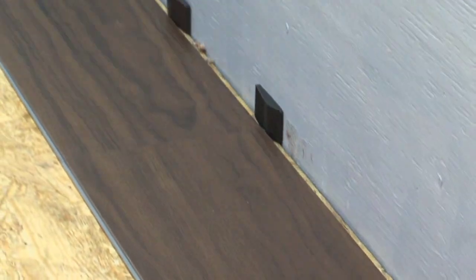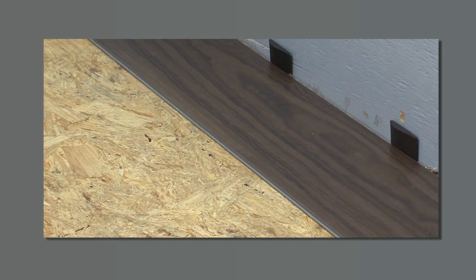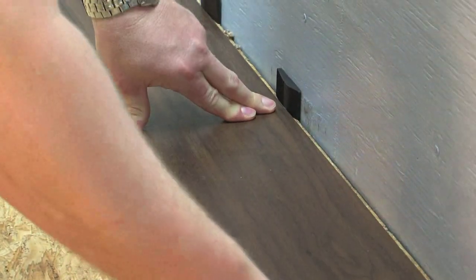Because the INSTEP locking profile is designed to install luxury vinyl tile without the use of adhesives, do not adhere product to the subfloor or attach moldings to the product. Install the planks parallel to the wall and proceed by working left to right in front of the boards. Complete the entire first row using this drop and lock method.